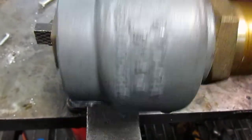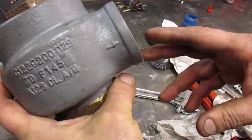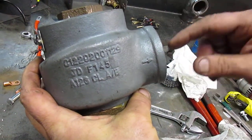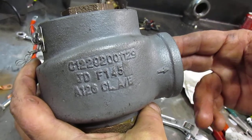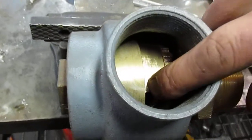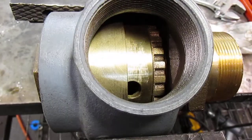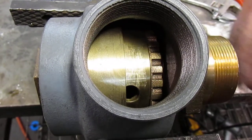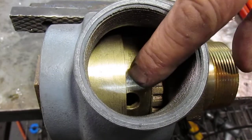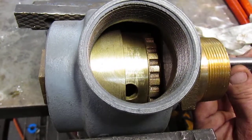So how does it work? If you look on here, there is an arrow — this is where the air gets sucked into the blower. This will be connected at the inlet of your blower. As the air gets sucked in from your tank, air also gets sucked in out of this chamber. Inside there is a hole. Inside of this chamber, it is the same atmospheric pressure as inside of your tank, the same as the air that we breathe. So as the blower starts working and creating negative pressure, it's going to start sucking air out of the tank, and at the same time sucking air inside of this chamber through the hole, causing this piece to start closing.